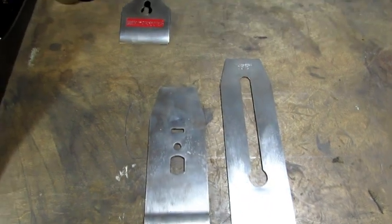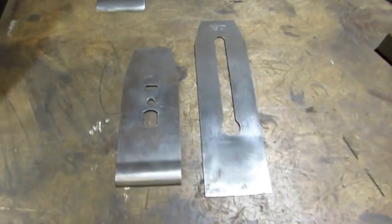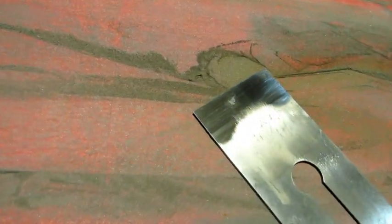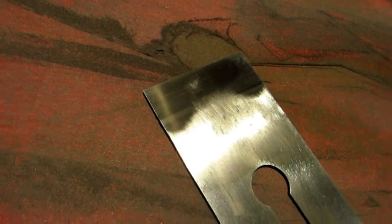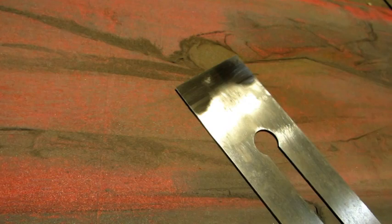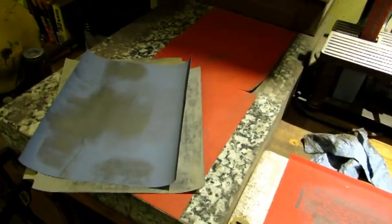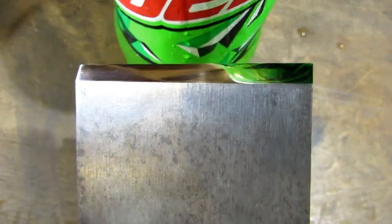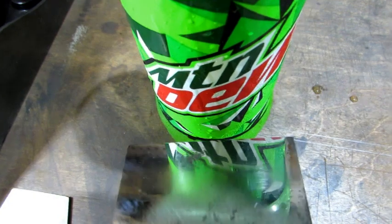There's a look at the front side. The paint dried really quick on the lever cap, so it's ready to go. Next is to sharpen the iron — I've got a really good video that shows you how to do that. The first step was to take it to my lapping station and get enough of that top side flat to get a good edge. Somebody in the future, if they're going to make a user out of this, has a little bit more to do — when you take off about another quarter inch, you're going to be into some shallow pitting that'll have to be lapped out. Otherwise this is going to be a really good iron. After that I set the 25-degree bevel to get that initial edge, then I move over to sharpening and go 1000, 3000, 5000, 7000 grit paper — and it should be ready to go. With all the papers done, I've got a really nice razor-sharp iron. There's the cutting edge and there's the back side. Looking forward to test driving this one.